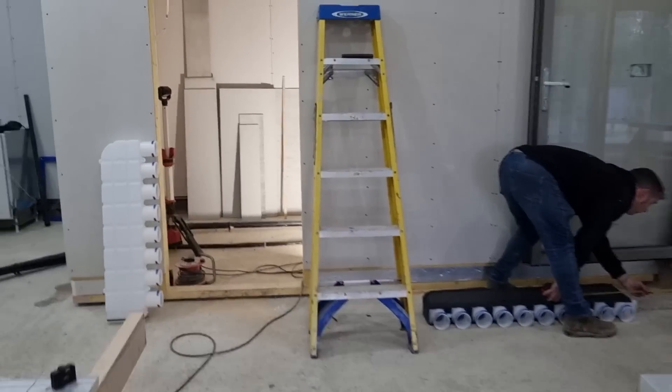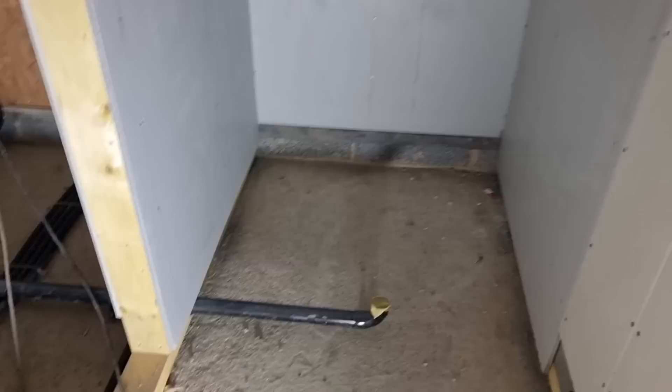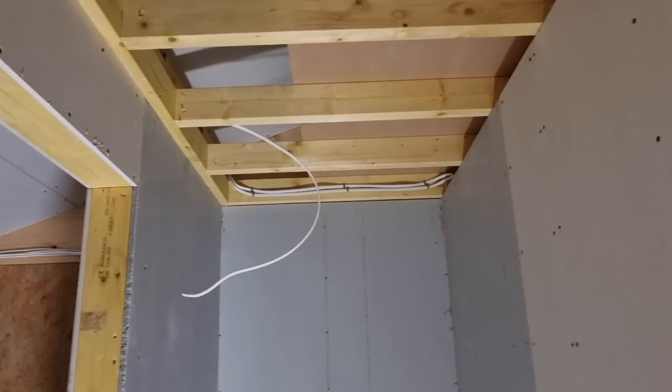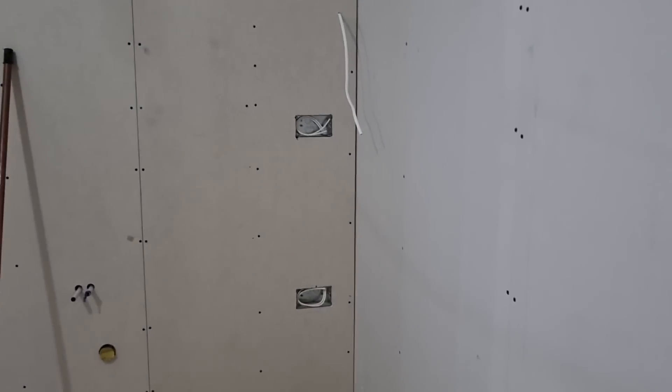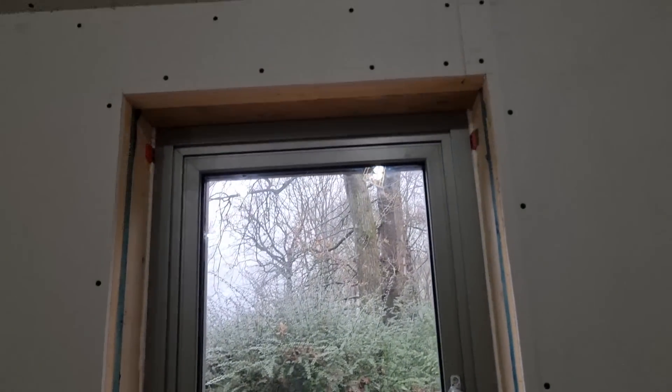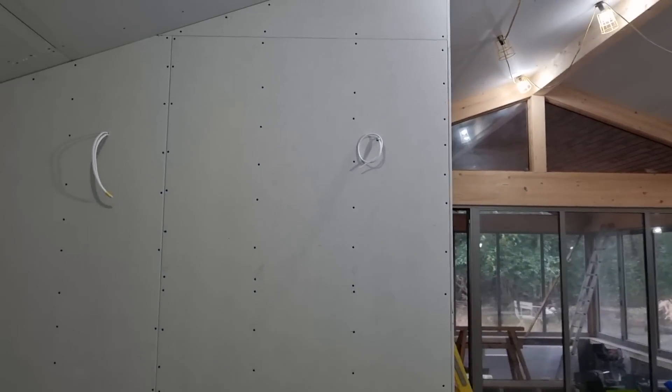There's one fresh air outlet here as well. Let's talk about the extracts — these are mainly in the wet areas. We've got a cloakroom and a shower, so there'll be one in each. We're also taking one through into the area with the small kitchen sink, because you could be generating steam there. All that stuff needs extracting. My windows here do not have trickle vents — they're airtight and sealed — so that's basically why MVHR is the solution for us.